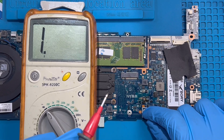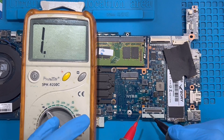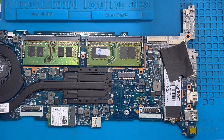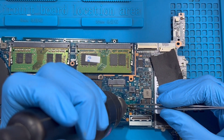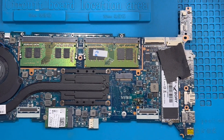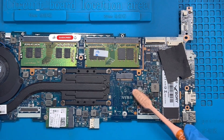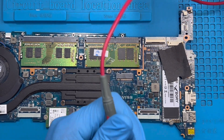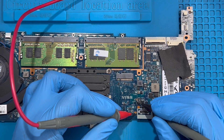This is the replacement capacitor — very tiny and very small. The original one was already shorted; that's why the laptop was not coming on. I'm going to get this part from another scrap motherboard and replace it. This kind of part you cannot get in a regular shop — you need a scrap motherboard to source it from. Now fixing it... already fixed. Then clean it a bit and remove the oil. Read again to check for any shorts — as you can see, no shorts: one side reads negative and the other side reads positive.